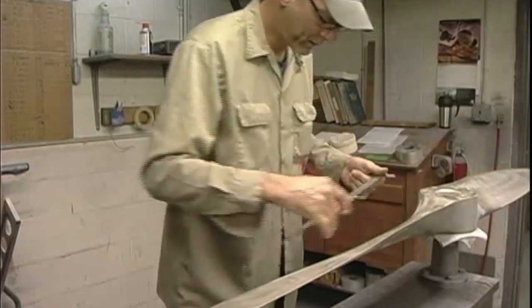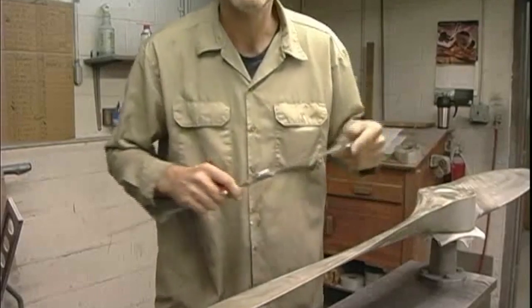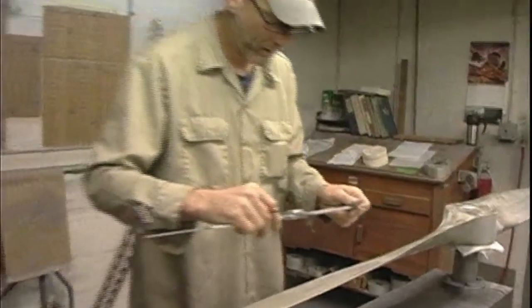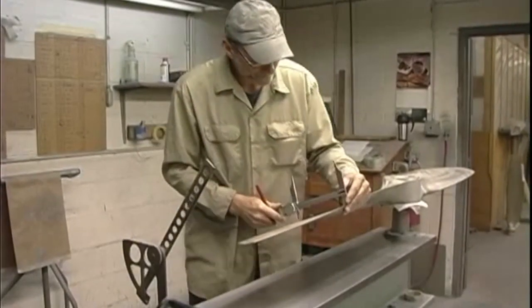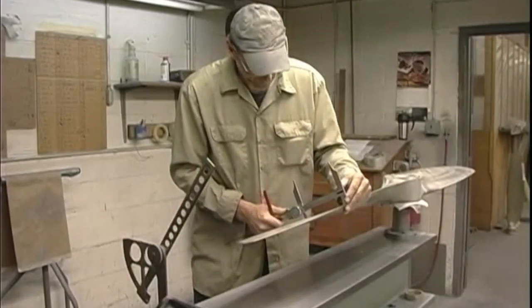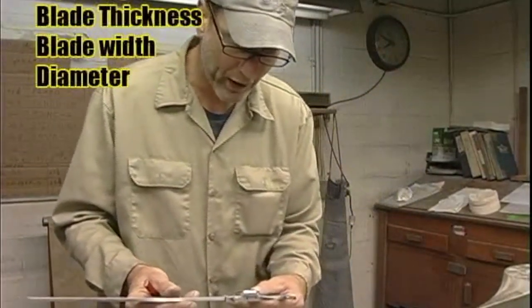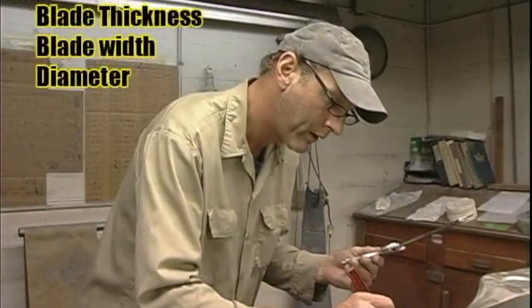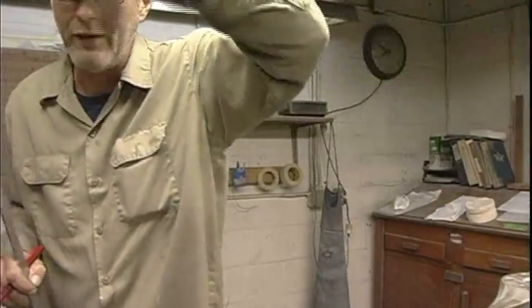Tony, the technician, will take us through all the steps to overhaul a fixed pitch aluminum propeller. We apologize for the machine shop noise, but this was just another day for the folks at Sensenich. Business as usual. So anyway, what I'm doing now is getting all the before numbers, writing them down, and then I'm going to check edge alignment, tip elevation, track, all that stuff before I start, because I can always adjust it as we go.